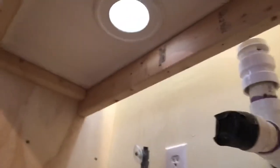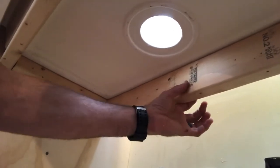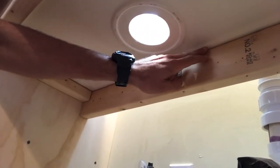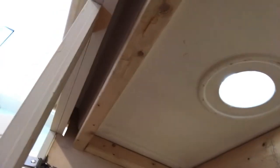When you put the countertop on here they'll put a bead of silicone around it. The countertop will go wherever the countertop people and the homeowners decide is the best fit. You've got enough room to mess with the sink below with the drain. This two by four is sitting on an inch and a half platform at this sink. You can see this little chamfer leads to a little flathead — that's what this two by four is sitting on. That's what holds the weight.